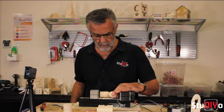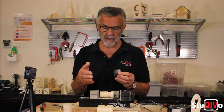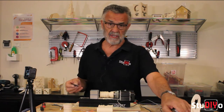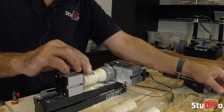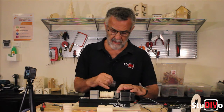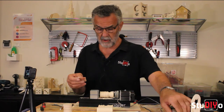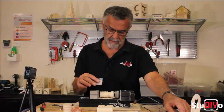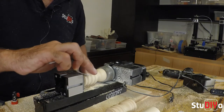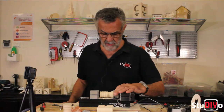Shaping is done. I've gone ahead and done some sanding of the piece. I've folded my sandpaper very small and I've got different grades here — coarse, medium, and fine. I start with the roughest one first as the work rotates, smoothing out any grooves left from the cutting tool, remembering not to go too close to those jaws. I then use the medium grade to remove marks from the coarse piece, and last of all the fine paper, getting to a stage where I'm happy with the result.